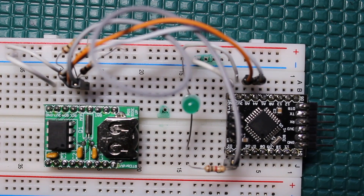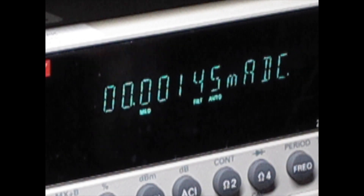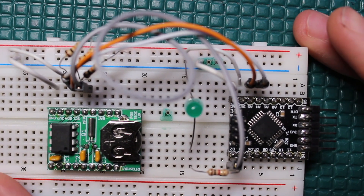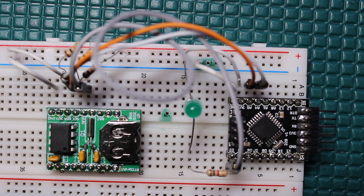It's got a sleep current of 1.4 microamps — I've got the calibrated benchtop meter up there measuring the input current to this system. That's really good. The device can sleep like that until it needs to wake up at the specified time. A lot of this builds off my other videos on low power design.